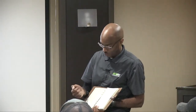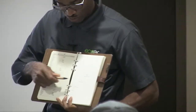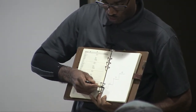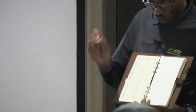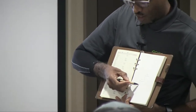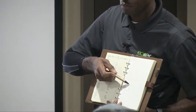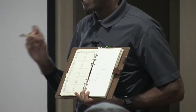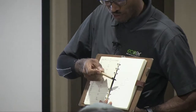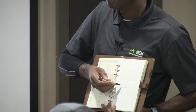When you have a load condition, say you have a system that has four stages. This is stage one, where the compressor is going to start. It can run at this stage, this stage, or this stage. These are the stages it can run. If your load condition is here, the compressor is going to run up here, so you're using more energy than needed to meet your load condition down here. But the unit can be marketed as a variable speed product because it does vary. They're not incorrect that it varies, but it's not varying in the most efficient way.